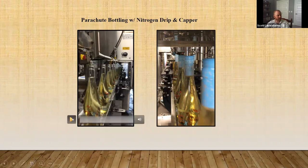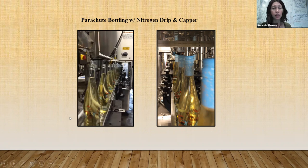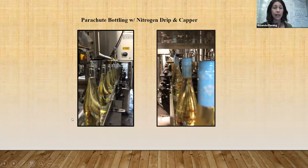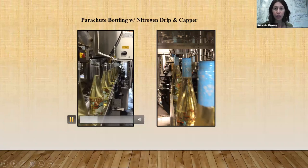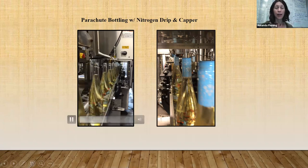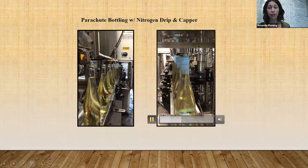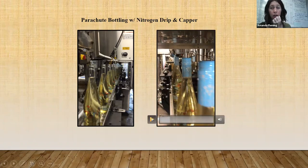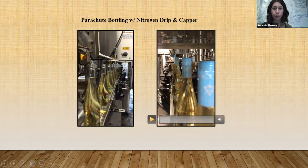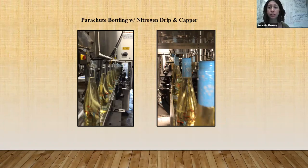I'm going to start this short video which shows the liquid nitrogen that Amanda uses at Post Winery. Amanda, do you want to describe it? This is our Parachute — a frisante wine going under screw cap. In the video on the left, it's receiving its inline nitrogen drip. Towards the very end you see that cloud coming up in the neck of the bottle — that's where we're diluting that oxygen and lowering that headspace oxygen. After that inline drip occurs, the second video on the right shows the caps going on. We've got a four-head capper moving along at a decent clip.